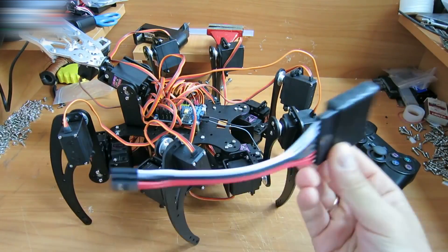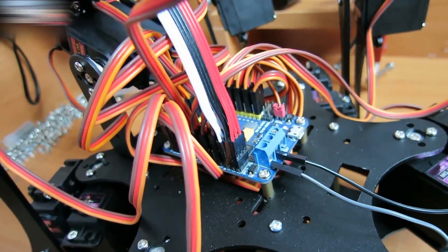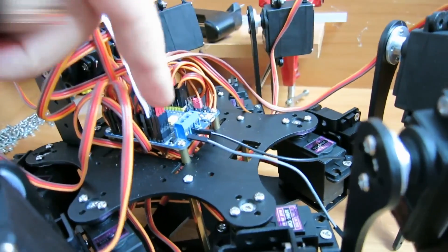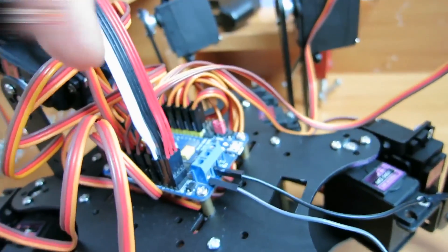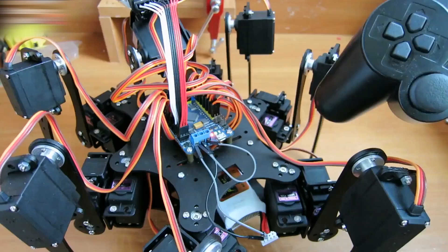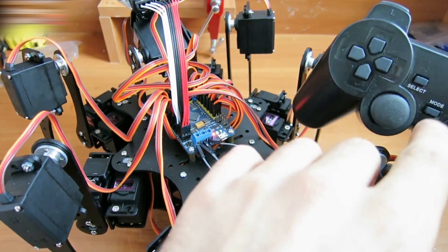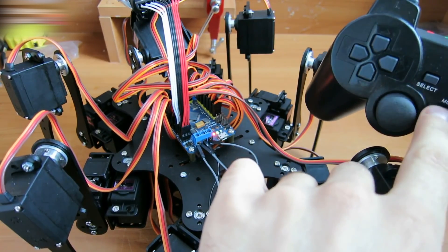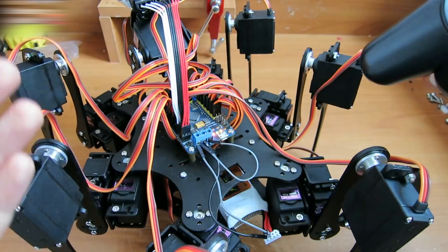This is the connection scheme for the Sony PlayStation 2 receiver and the microcontroller board. PS2 receiver — this is pin 1. Connect the microcontroller board to the Sony PlayStation 2 receiver with the wires included in the receiver set. Connecting the power — it's 5V here. Shift the jumper from the VCC to the 5V to power the microcontroller. The ground is the same for all. Pull this jumper out before connecting the power. Connect the power and start the joystick. Press the Start button. Press the Mode button. An LED light is on, indicating that the connection is working.